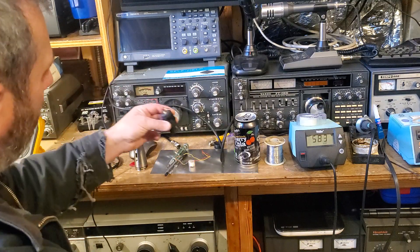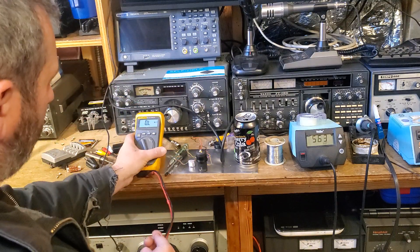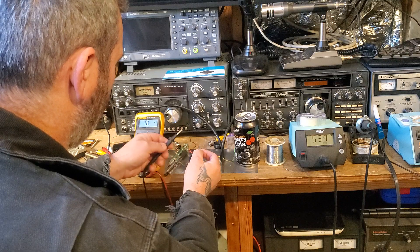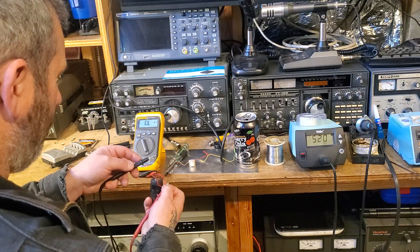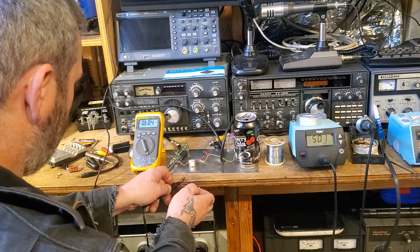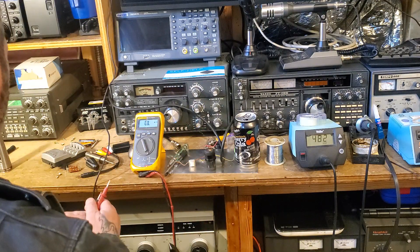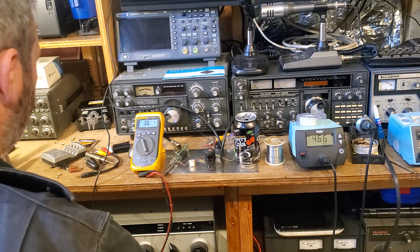The element itself is right here, and it should be low impedance. If we take our meter and check it, I think we'll find that it'll be below 600 ohms. Make sure that you don't touch both of the leads with your fingers, because you'll be conducting through them. It's 0.604K, so that's 604 ohms — not ideal for pro audio, but it'll work for what I want to do.